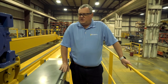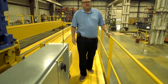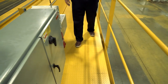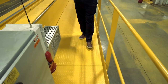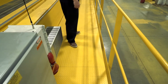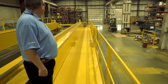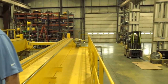We feature OSHA required clearance in front of our electrical panels. We have a rigid hand railing and intermediate system along with a toe kick board. This unit has a checkered floor plate, but we can also do expanded metal or bar grating as the application requires. We also have at the far end a self-closing boarding gate so maintenance personnel can access the crane from a man lift or the end of the aisle, and we can customize that to the facility's boarding needs.